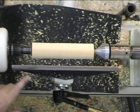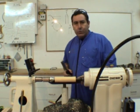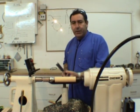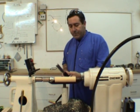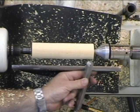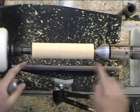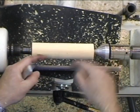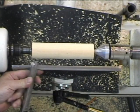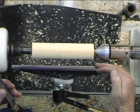And this tool rest is not from the same lathe, like one way. This tool rest comes from a Woodfast lathe, and I really like the shape of this tool rest. Okay, I can use my finger to always keep the tool parallel to my tool rest. This is the reason I hold my tool parallel to the center. Okay, you can see now again my finger here. It's easy for me to follow the parallel from the tool rest. Okay,